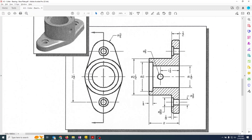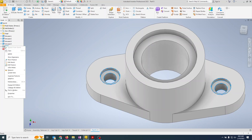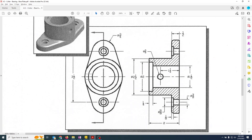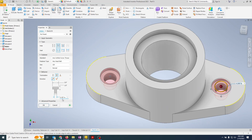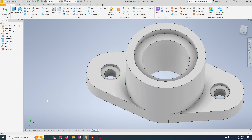Now thinking about it — we set this up as a clearance hole, so it's actually going to be a little bigger than what our drawing calls out. The drawing says make this 0.375 exactly, not a clearance fit. I'll override it and set the diameter to 0.375. My assumption is we're putting something through here that is smaller than three-eighths.